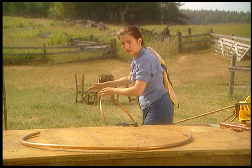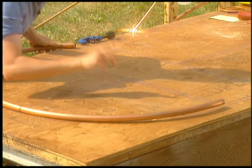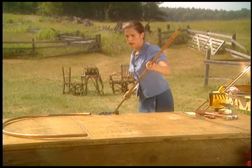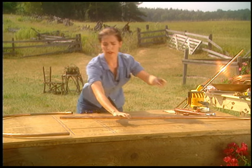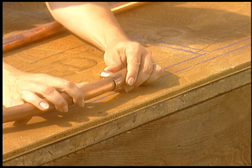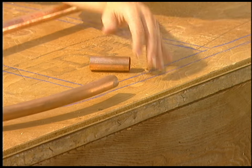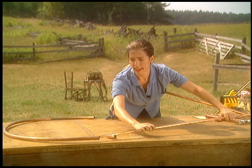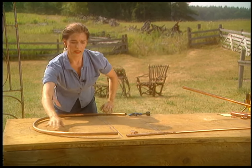Now this has to be straightened to fit the arch. It has to go into another piece of rigid copper pipe through one of these connectors, but with the amount of curve in that pipe right now, the connector won't go on past about a quarter of an inch — and it needs to go in all the way. One way to straighten it is by taking another piece of pipe and putting it on the end like that and then straightening it out. But first let me work with the length of it because it's a bit wacky right now.